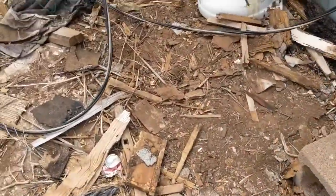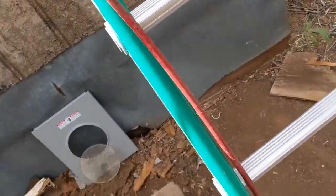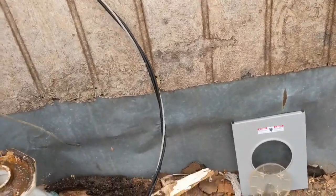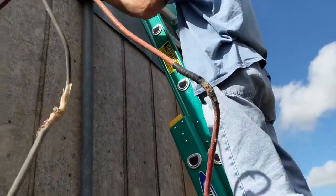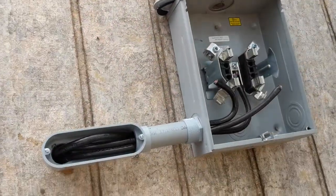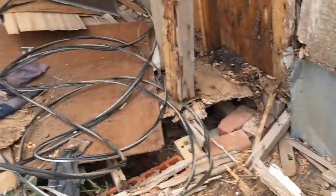Okay. The other thing, this seems very narrow. Oh, good. You pulled the wire out? The anchor usually has something on it, you know, the size for the anchor. It's 1 1/4. Okay. So we got to change this out. I thought this was 2 inches. Did it say it's on the weatherhead? It says right there. 1 1/4. I had a bad feeling that that was it. Right, so we need to upgrade that to at least 1 1/2.